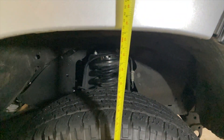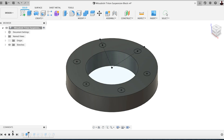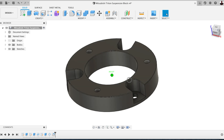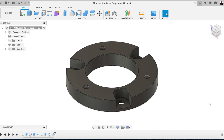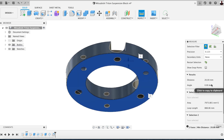If we look at the CAD model now you can see it's quite a simple design. I've redrawn this in CAD and I'll just go through my methodology here with you really quickly — you can see it's a sketch and extrusion. We've put some holes in there and a little pattern of those slotted features. I set all this up using parameters so I could change that height, and just to confirm that we went from a 25 millimeter spacer down to 20 millimeters.